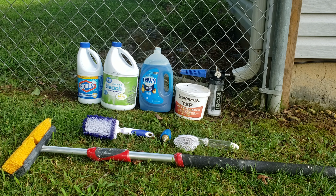Next, we're going to be using Dawn — in this case, Ultra Dawn. The reason we're using Dawn is it acts like a bonding agent. It's going to do minimal cleaning itself. The main reason is when you spray the chemicals on, it allows them to sit on the surface and do their work for a while, instead of just running right off. So the Dawn gives it that bonding agent to let it sit there, work its magic, kind of kill the mold, get rid of dust and dirt, and give us enough time to get in and brush or agitate with a brush so we end up with a much cleaner surface.